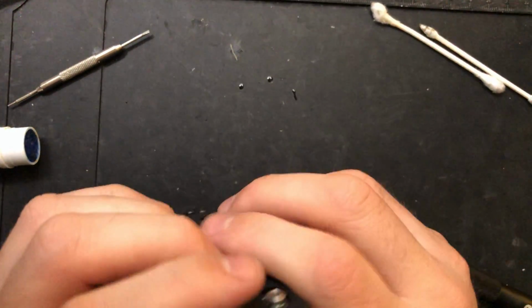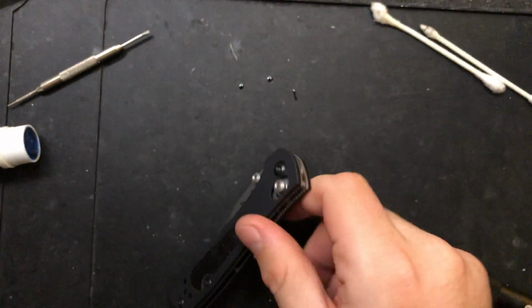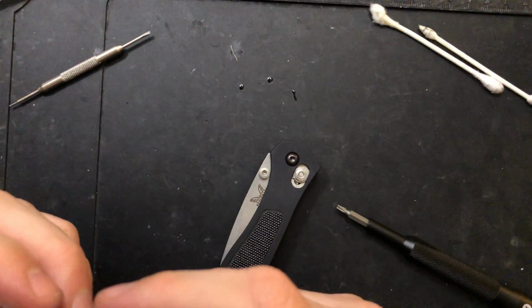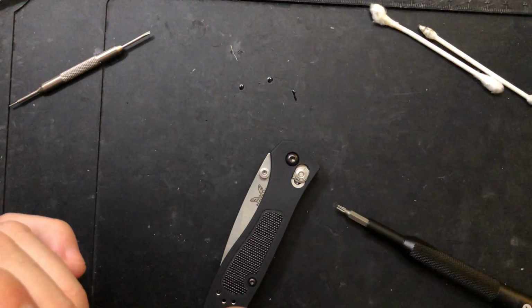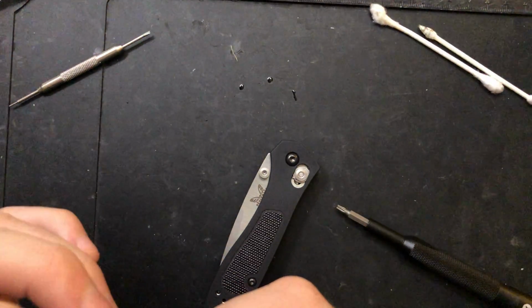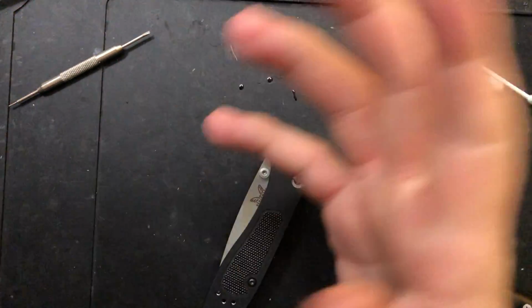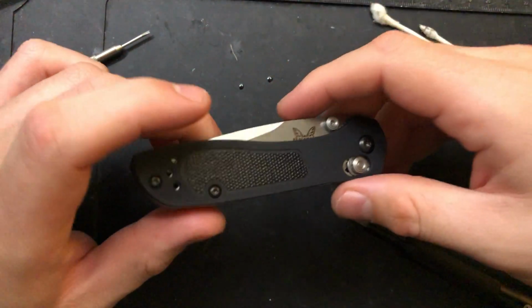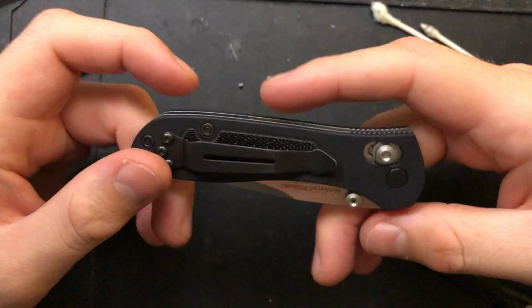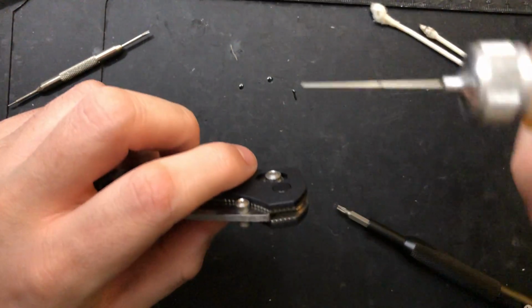And the reason I'm not going to screw with this is just because I want the Loctite to set here. Loctite thread locker stick here is, let's see here. Does it give the curing time here? Oh, of course not. But it's something like, it's at most strength within 20 minutes and more within 20 hours or 24 hours, something like that. Whatever it is, I want this pivot to get into good position here without me messing around with it.